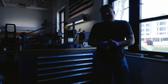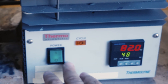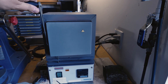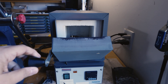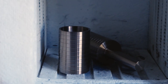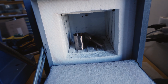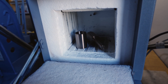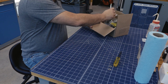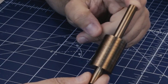Now we wait an hour and we should be good to go. It's been an hour. I'm going to turn off the power and now I just need this to air cool. You can see they've taken on a slight yellow tint. The slight yellow tint is what we expect from this material after heat treating — the surface just oxidizes just a little bit. So here we have the rollers with this nice color on them after heat treating.